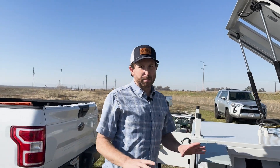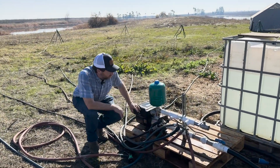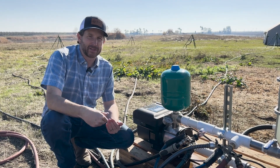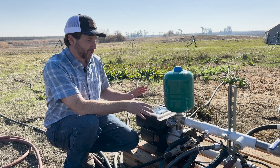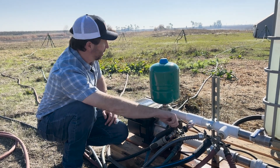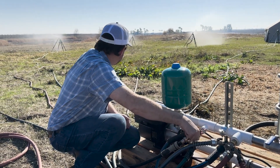Let's check out the pump and see how it's operating. This is a three horsepower EcoSteady booster pump with soft start. With this inverter, it will handle around 10,000 watts — that can start around a one and a half to two horsepower motor, but with soft start we can start bigger motors. In this case with three horsepower soft start, we can go all the way up to a five or even seven and a half horsepower pump. The pump is on — it's as simple as turning on where we need the water and letting the sprinklers fire up.